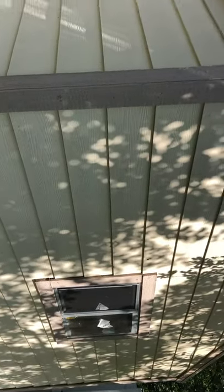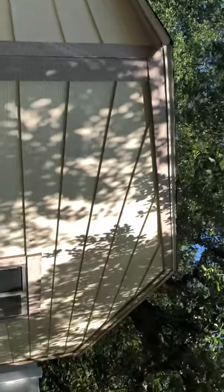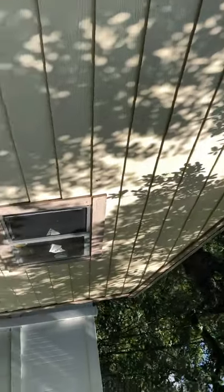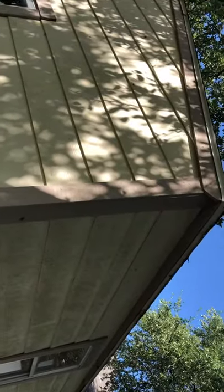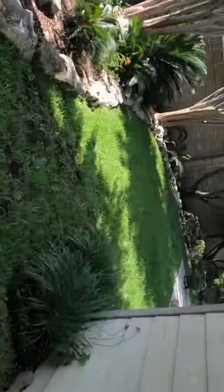That rot repair is part of what we're fixing. To recap the shed scope: corner one-by-four trim, all windows wrapped in one-by-four will receive hardy one-by-four, and the rake-end or gable-end fascia will all be replaced with hardy one-by-four. On the back wall, trimming out the window with corner trim on both sides up and down — one-by-four. Then just painting the trim we're replacing, not the entire shed.